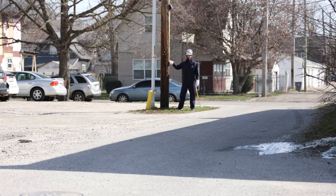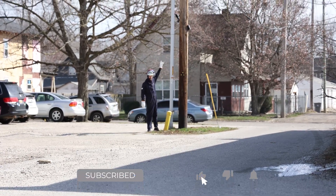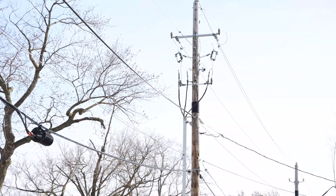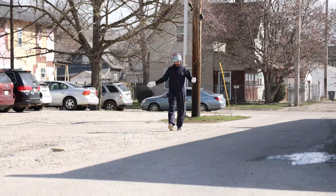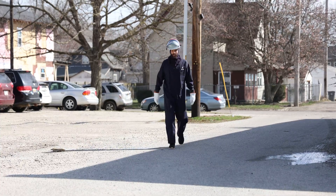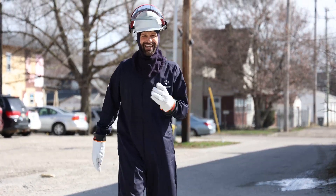I'm standing at the base of our utility pole. We're going to talk about arc flash safety risk in a couple of minutes here. At the top of this pole is three-phase power — insane juice coming down through one four-inch PVC riser, approximately 100 feet underground to our dedicated utility transformer. The service in question today is a 400 amp three-phase 120/208 volt service with a ton of potential behind it. The fault we're going to experience is probably going to exceed 2,000 amps.